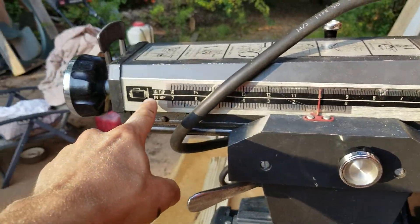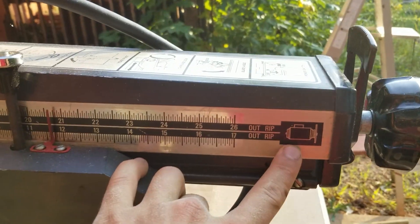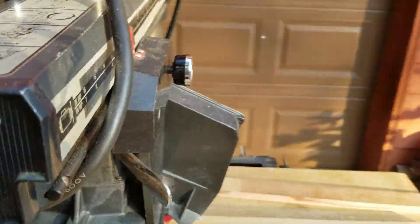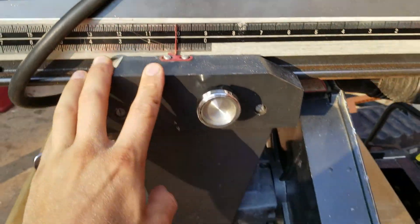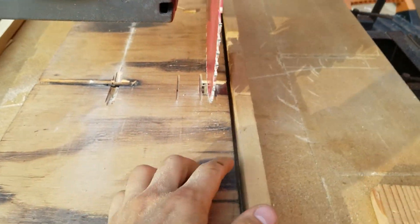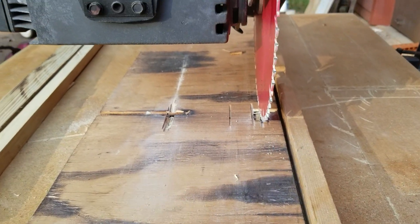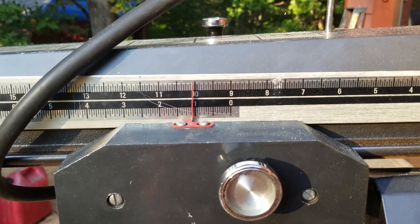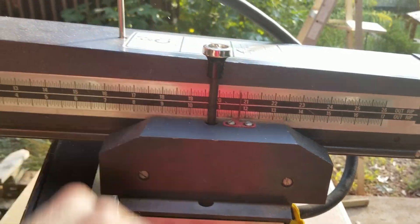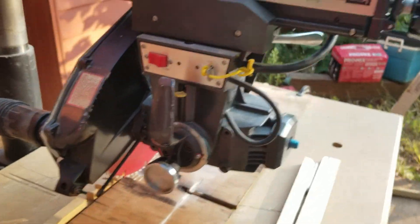You can see right here these quick adjustments. This is in-rip — see it's like that — and then on this side it's got out-rip. It's supposed to be like that, so you can see the blade orientation. It's got these quick settings so you don't have to use a measuring tape, which is really cool. You can adjust the pointer here. For the in-rip, the manual says it should be one inch right here, with a kerf obviously, so one inch from here to here. You just got to adjust it and play with it. For out-rip, you spin the saw and do the same thing with the blade out here — a foot should equal a foot up here.